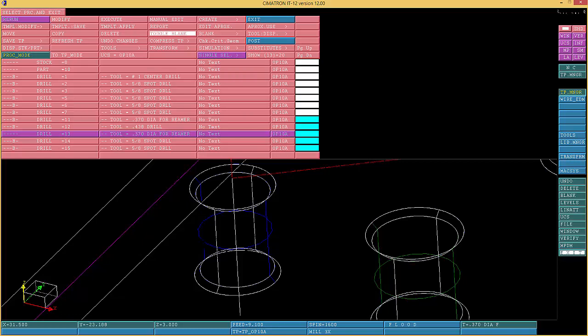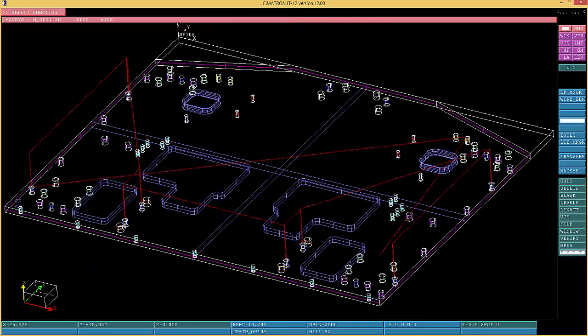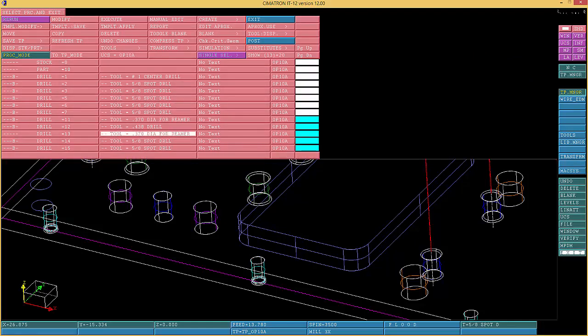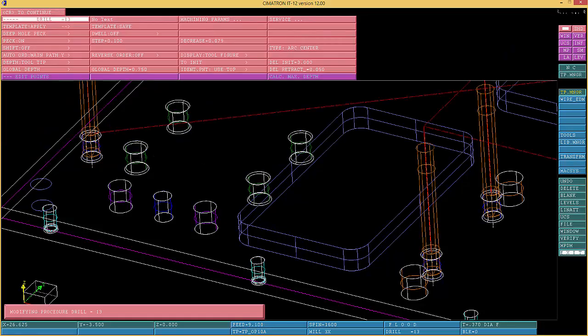Actually, it's not 3D, it's 2D, but on free-form surfaces, your plane is going to change everywhere. So everywhere you go, it's a different Z on the top. The plane has to be close to the hole and all that. Otherwise, you're gonna have to create a plane right on the top, and the plane travel is gonna be very long. So I think I have a little file on that, and I'm gonna try it out. I'm gonna machine it, and you'll see what it does.